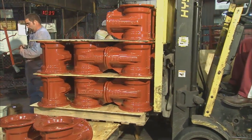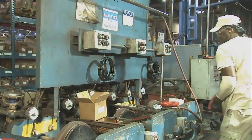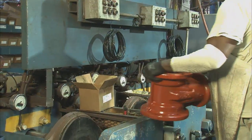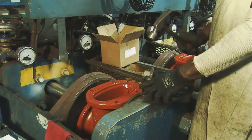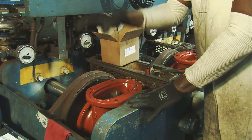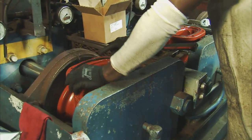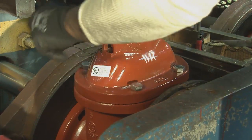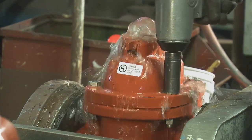After passing a thorough inspection, components are brought into the assembly area where journeyman assemblers build and test each valve in place for maximum quality. An iron body is implanted in the testing bench and a vulcanized EPDM rubber wedge is inserted into the body. A rubber O-ring is then moved into the body O-ring groove. After the O-ring is installed, a bonnet, or cover, is laid onto the body where they are bolted together using 304 stainless steel bolts and nuts.